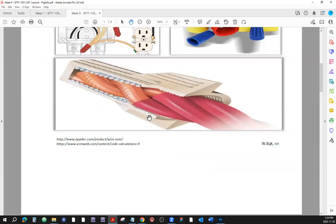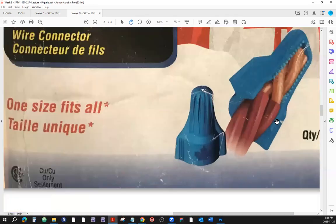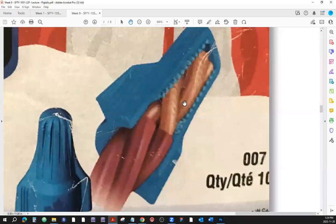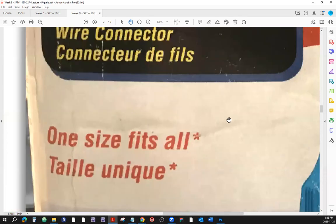Like, for example, here. All right, here's another example. The wire nut turns clockwise and the wires are pre-twisted clockwise. Right? If the wire nut tightens, this thread is going to make that twist even tighter. And that's what we want. Also,